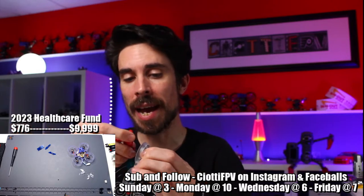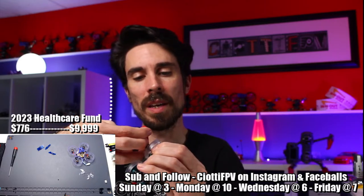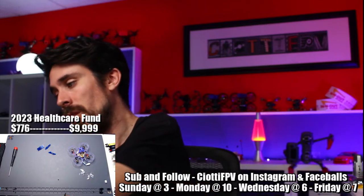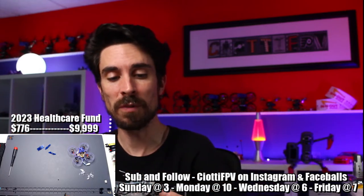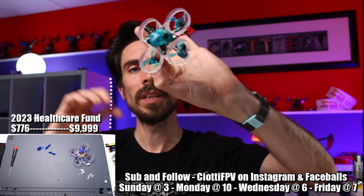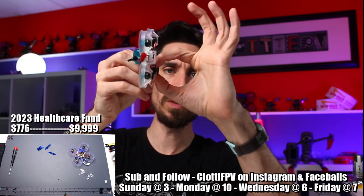The other thing I don't like about the Azzy props is they get stuck on the motor shafts. The inner diameter of the prop hole is a little bit too small, in my opinion. You don't ever have to worry about the props flying off the motors, but you have to worry about ruining the motors when you're trying to remove the props. The best way to do it, I showed you yesterday on the live stream: pinch the motor, watch the motor wires. Don't touch them.